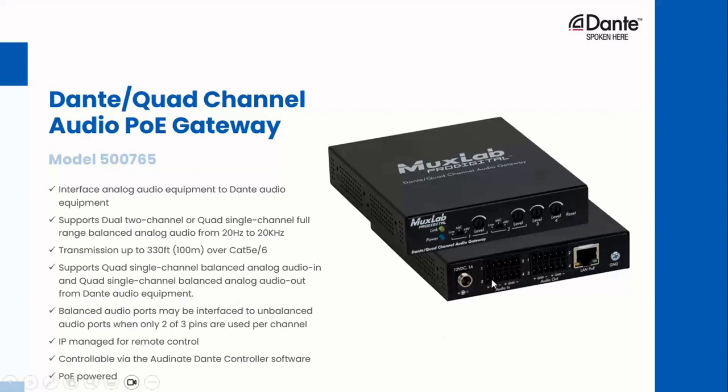The 4 channels in and 4 channels out on the analog side support both balanced and unbalanced signals, and you can combine them into dual stereo if you like. We also have support for line level on those ports, as well as 48 volt phantom power. So if you've got a microphone, you can also support that on the analog side and send that into the Dante world and get those signals back as well.